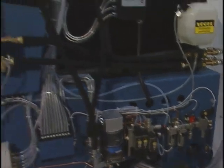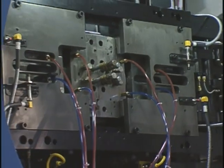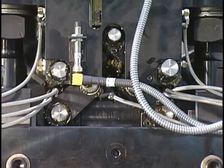The platens, which support the slide guiding systems, are water-cooled, as are the shanks or slides. On all but the smallest machines, the slide guiding systems are equipped with replaceable wear plates. An automatic lubrication system is available for all machines.